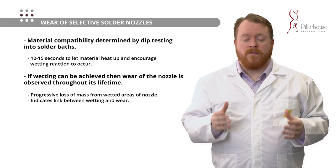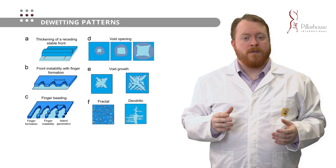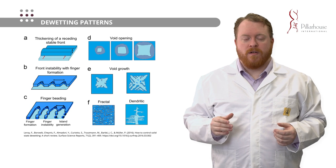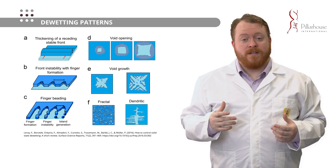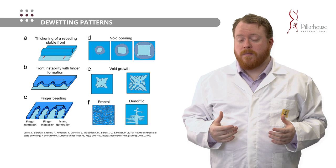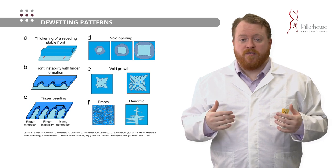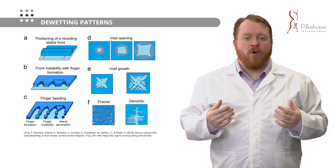Mechanical properties did not feature as a controlling element in the wear of these nozzles. If we have a non-wetting nozzle or a material that doesn't wet completely, we would actually see what we have on this slide — de-wetting patterns. This occurs when the solder cannot form a good interface with the nozzle material and instead begins to withdraw from the surface. This can happen in various patterns — voiding, dendritic formations of the liquid — wherein the film of solder is not stable on the surface and will begin to withdraw. This is the effect of surface tension pulling back to form a low energy shape.